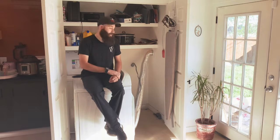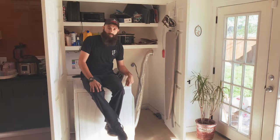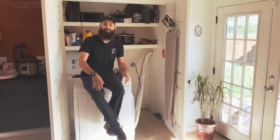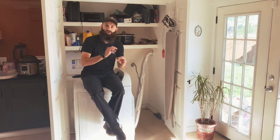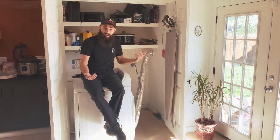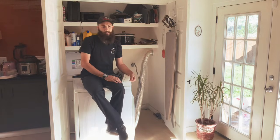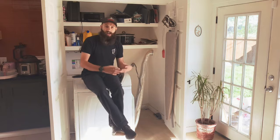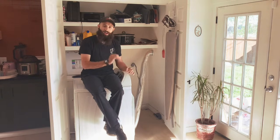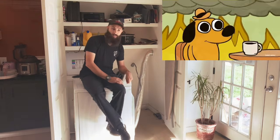The way we're going to do this today is we're actually going to pipe into our dryer because our dryer has a 30 amp plug. It's already ready for that type of voltage to come into the house because it has a larger gauge of wire and it has a shorter span to the breaker box in most cases. When we're going to be running a lot of power from a generator into our house, we don't want to do that through a 120 volt small wire plug, because you'll get it way too hot and you'll catch your house on fire. So do not do that.